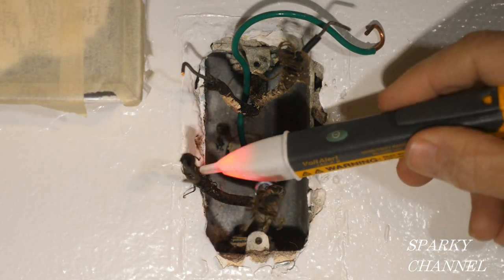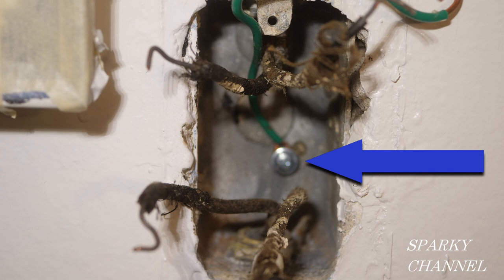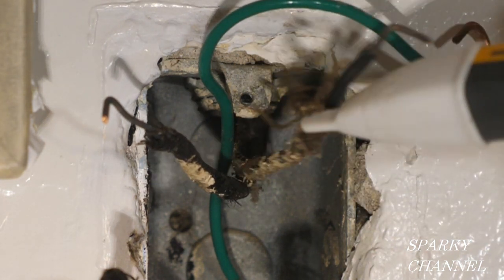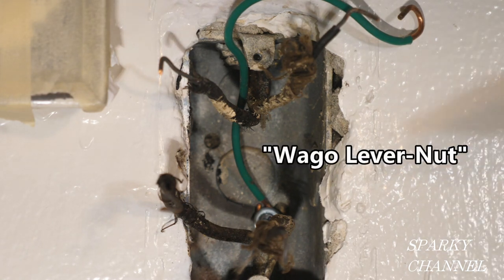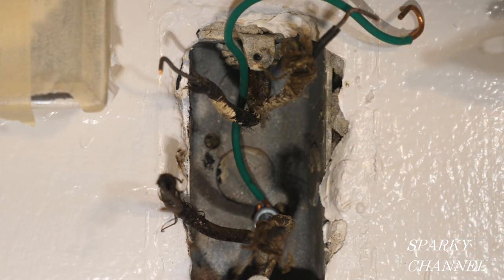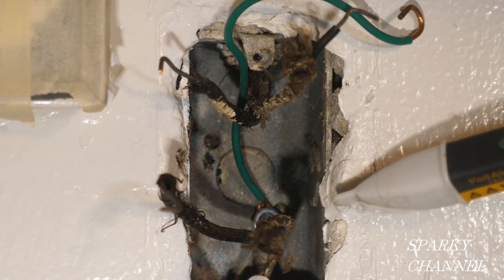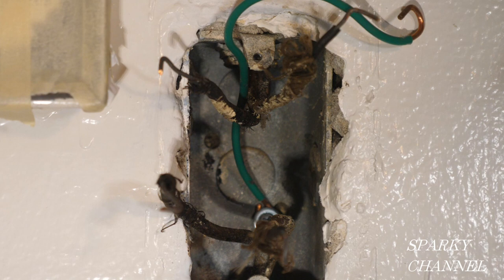You can see by observation that this is one cable and this is one cable, and then this is a ground wire — I'll discuss how the ground wire was connected to the box in just a minute. These old wires are not in the best of shape, so I'm going to cover each of the ends with a Wago lever nut for safety, then turn on the circuit breaker and find out which wire is hot all the time. That will tell me which one is the line cable — the cable coming from the panel — and the other one will be the load cable that takes current to the next downstream receptacle, protecting it.